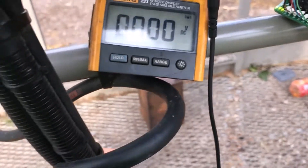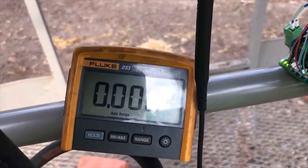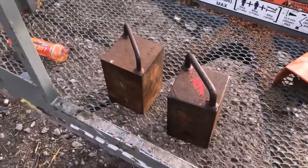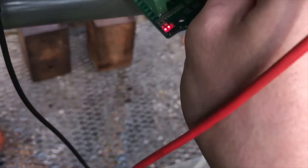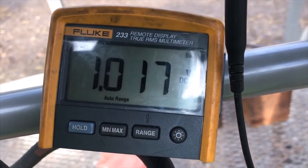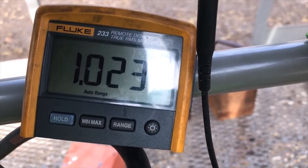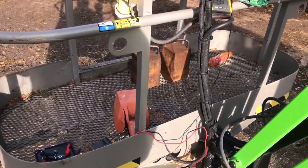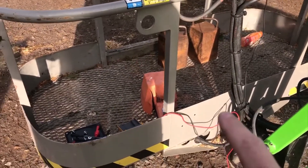So if I'm going to put another 25 kilos in the cage, I should be reading about one volt. So now we have two 25kg weights - so two 25s. We are expecting to read about one volt. If I go to test point 1, we have one volt - 1017 millivolts. And if I go to test point 2, one volt and 23 millivolts. So one volt is not meaning that it is a hundred kilograms inside the cage, but it's meaning the assembly plus the weights inside the cage is around a hundred kilograms total.